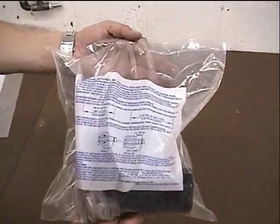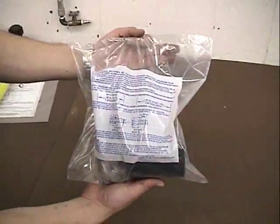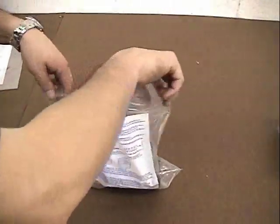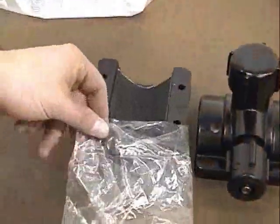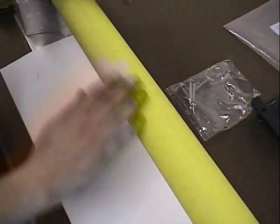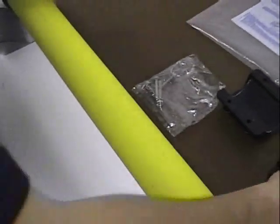Eliminator Saddle by Compression Outlet. All of our products come packaged in a plastic bag with the instructions either enclosed or printed on the outside of the bag. If the instructions are printed on the outside of the bag, be sure to open the bag at the top, being careful not to tear the instructions. This bag contains the Eliminator Saddle, Saddle Bottom, and four mounting screws. The use of Continental's tapping tool is recommended to help make the process faster and easier. The area where the saddle is to be installed must be clean and free of cuts and scratches.